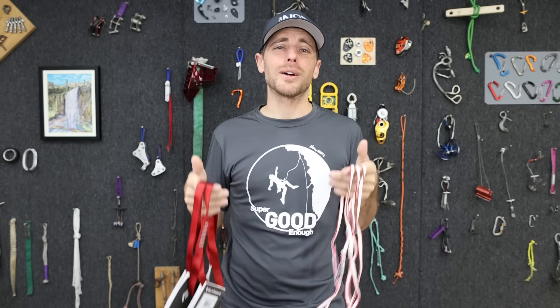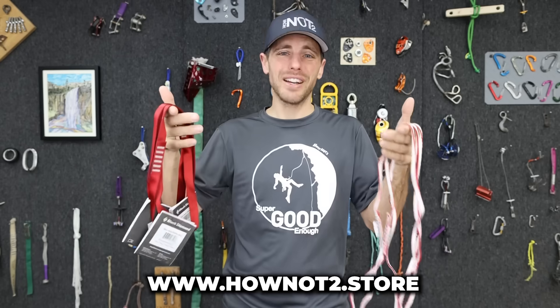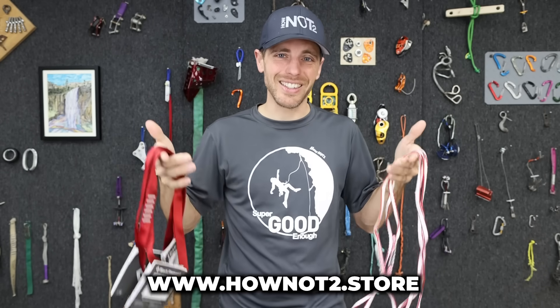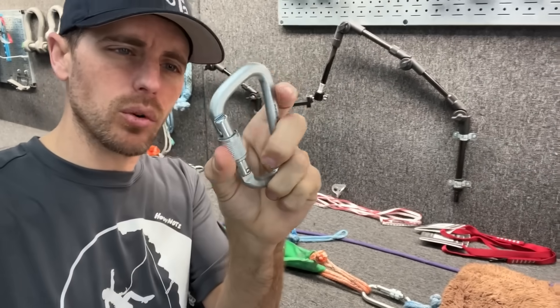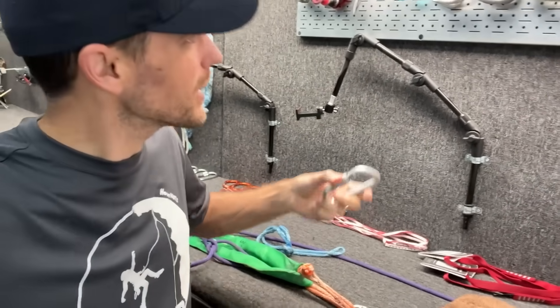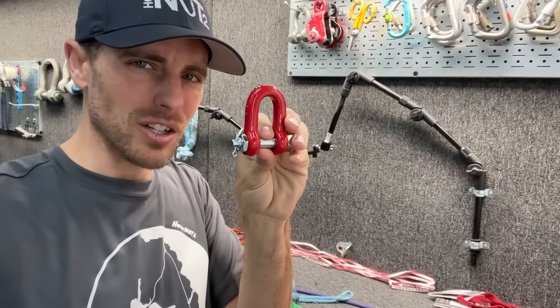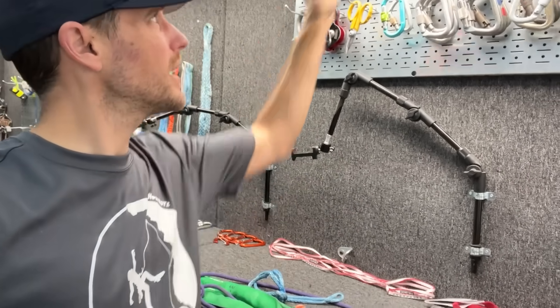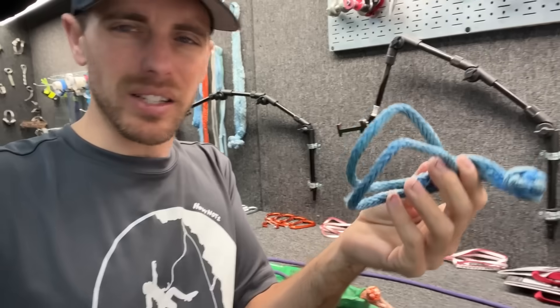I've been planning this episode for about six months. I didn't have a store when I started, but I do now and I carry all of these products in it. Let's start with the cryo-treated ones first. We're not going to connect a steel carabiner to break a steel carabiner. I don't want a shackle either since I don't want hard stuff going flying. So we're going to use some Dyneema, which is about 60 kilonewtons and about the diameter of a rope.